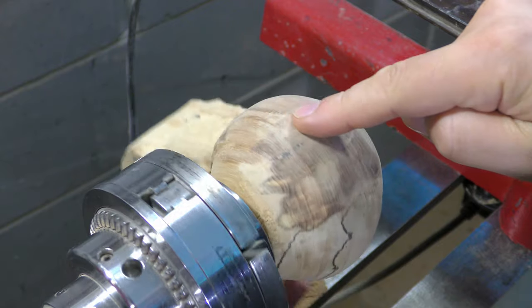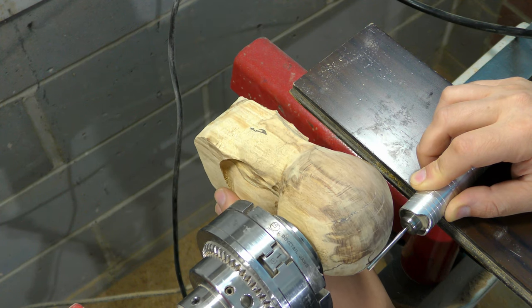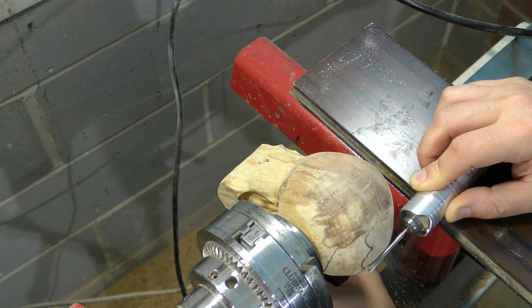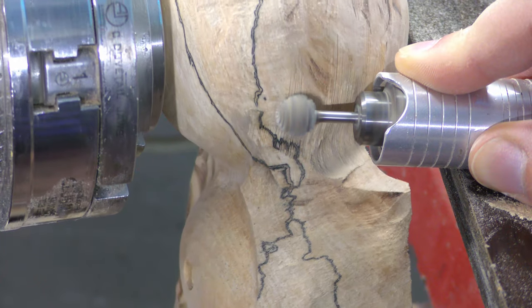Here is a simple trick I picked up during this project. Certain parts of this sphere cannot be turned because there are three stuck together and it's not circular anymore. I had a crazy idea I wanted to try. Curved tool rest — a curved tool rest with a platform hot-glued to it. I grabbed my rotary carver and put it flat on the tool rest. Don't move the rotary carver; you only move the piece that is in the chuck. This way you create a circular motion. I started with a spiral cutter, but later realized it works much better with the extreme coarse circular bit. It even works with the long-neck angle grinder.